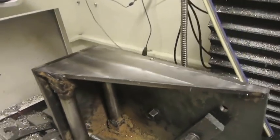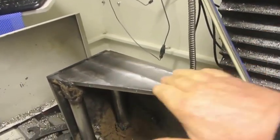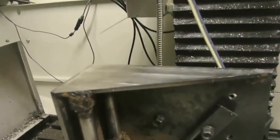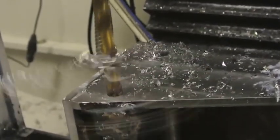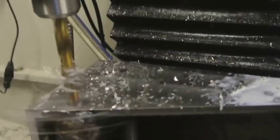There we have the first of the two sides done - nicely flattened off. That face is done. Just this lower face under here to do, and then boring out the holes for the other plate which swings. I'm just drilling the holes in this plate using Path Pilot Conversational. I've had a few problems with the drill - and I might have more problems when I break through, because this tube here is very slightly out of centre. Anyway, we'll see what happens. Hopefully it'll be fine.